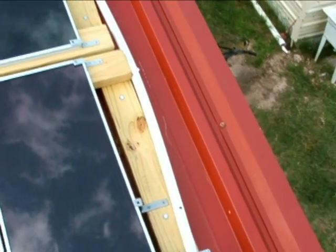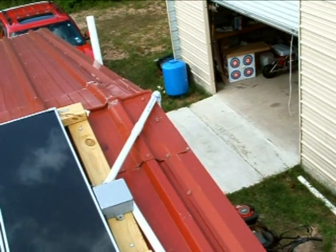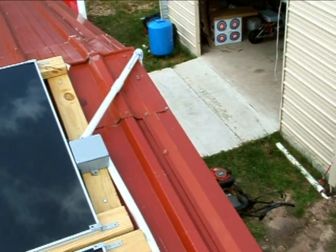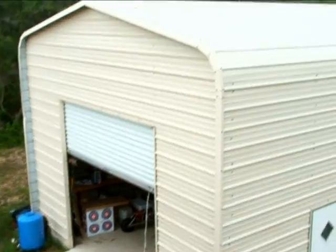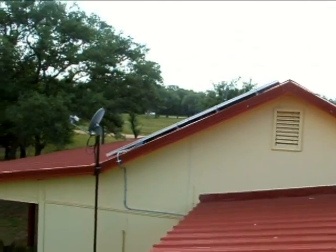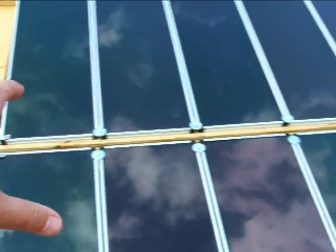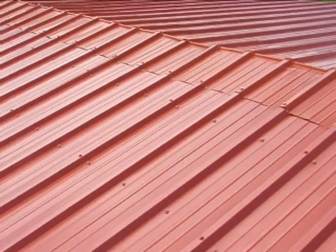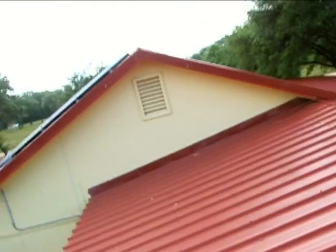They're working out pretty good. They're all tied into this and going out through PVC pipe — I had about a hundred feet of that stuff laying around, three-core range, so might as well use it. That's what I used to go into the shed. I have this solar here, and the solar over there is 1.6 kilowatts; this is about 210 watts. I've got another set of 14 panels to go over here, so that's going to be another 420 watts.